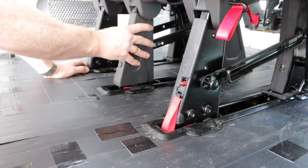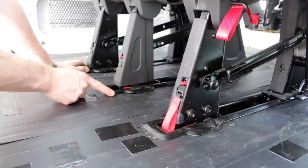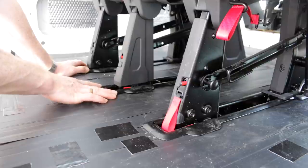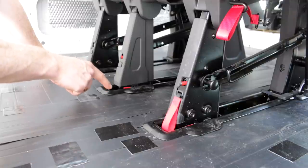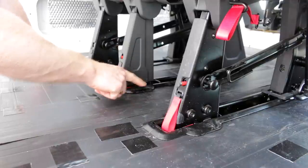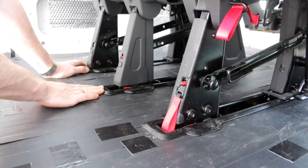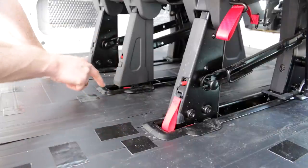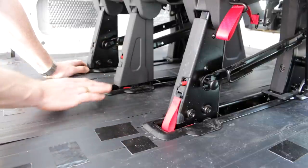And if this wall was out and we had our finished flooring, and then this humped area, even if we put a floor mat over there, these are still going to be a real lump, because this will be our walkway. So my plan is to cut and recess the plywood with a router in a way that the top of these is level with the plywood, so these will be sunk down into the ply, and that will just allow me to either cap off the hole that's here, or maybe just make an infill timber that slots into this hole, so everything feels flat under the rug.